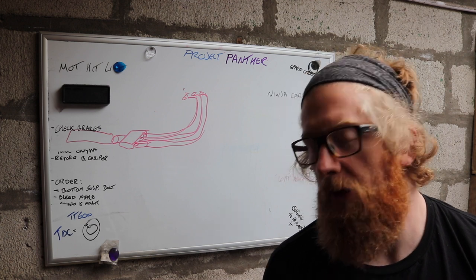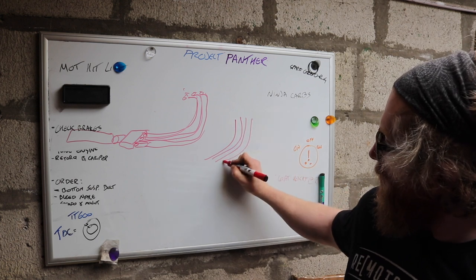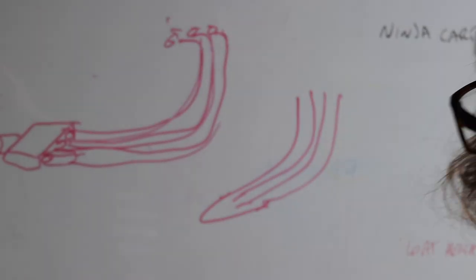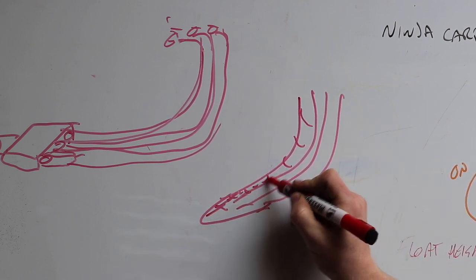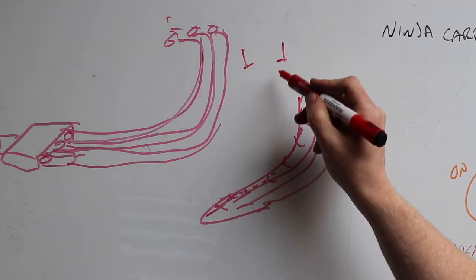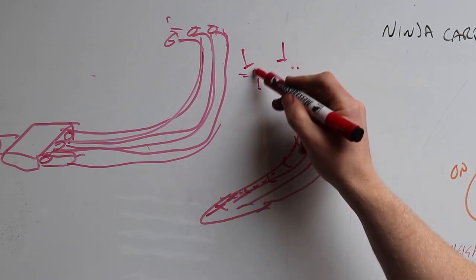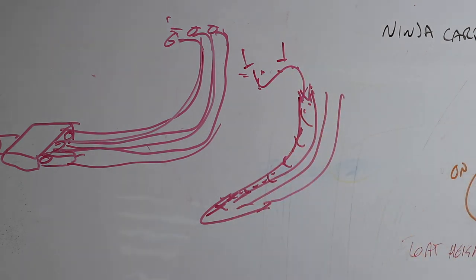So a lot of the reading I've done looks at what happens when you've got exhausts that go into a collector, say. This is a point where your exhaust gases then have something to reverberate against and go back the way, and the pulses go back up. As the engine runs there's a valve overlap, which means that both valves are simultaneously open, and the pressure differential within the exhaust and the cylinder itself causes exhaust gases to evacuate. If you don't get that right, then you leave yourself without a full enough volume within your combustion chamber to get the most efficient burning and all the fuel in for the next time.